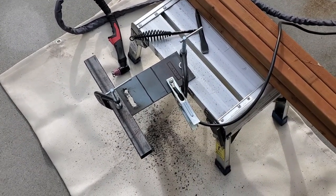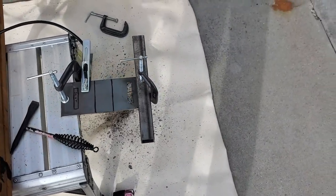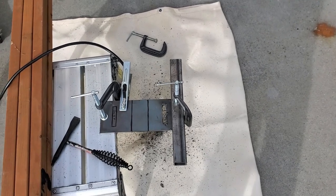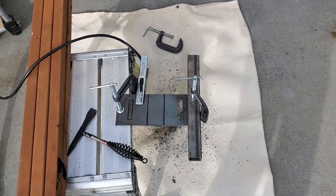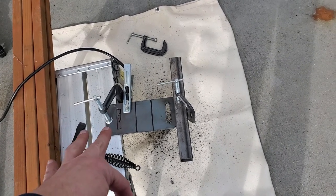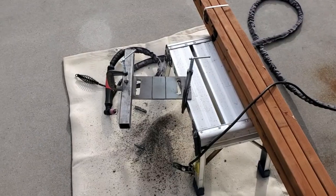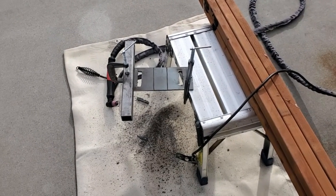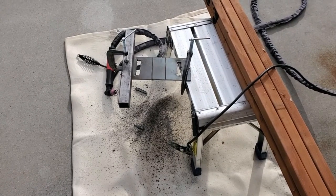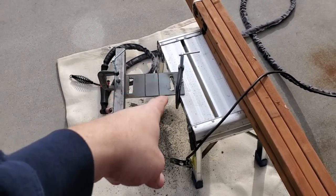I think quarter inch might be just a smidge too thick for this plasma cutter, but it's doing the trick — I'm getting the piece out and then I'll clean that up with a file or grinder. This is gonna be hot right now so I'm gonna put my gloves on and flip that around to do the other side. She's not pretty but I'm gonna still take her to the dance — that one went a smidge better. Now it's time to start cleaning things up a little bit and doing a little measuring to make sure they're the same.